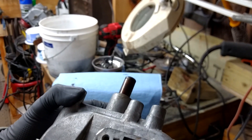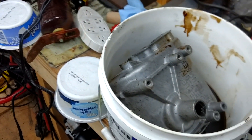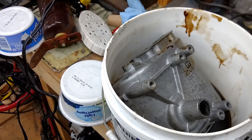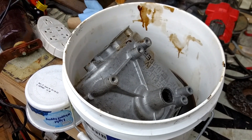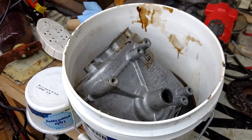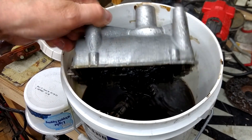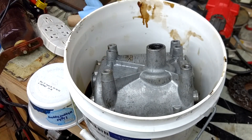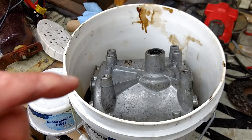I hope you won't be horrified, but I have the bearings soaking in gasoline. I'm going to put a little more in this bucket and put a lid on it, set it over in the corner, and make sure I don't do any work right around it — we don't want any fires in here. This will get it cleaned off really well, and then I can finish cleaning in my parts cleaner. If I put all of this stuff as greasy as it is into my parts cleaner, I'd end up having to replace the fluid, and at over 60 bucks for a 5-gallon bucket, it's a little bit cheaper to use gasoline.